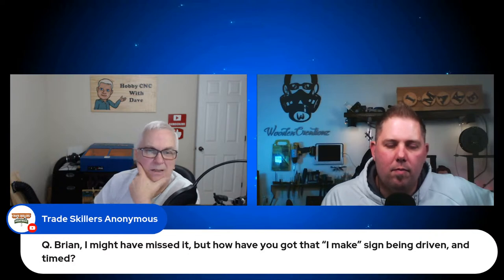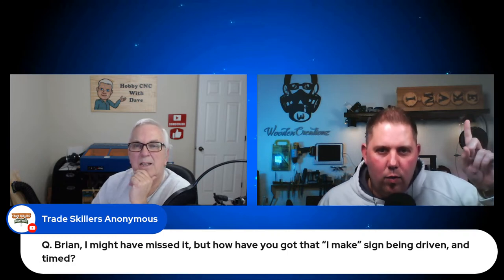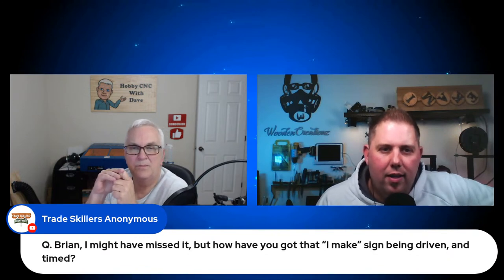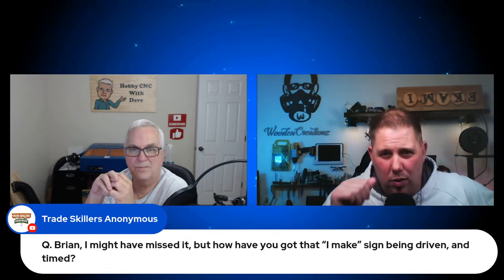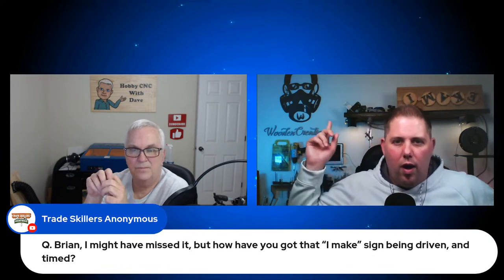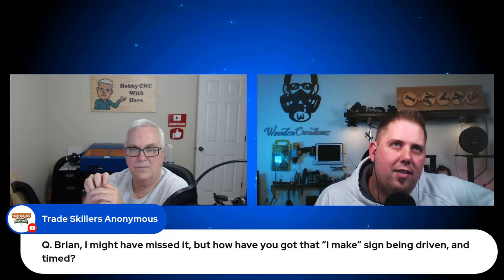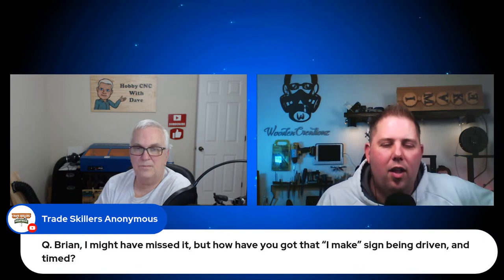All right. JR here from Trade Skillers Anonymous asks, Brian, I might have missed it, but how have you got that sign being driven and timed? So what I've got is a bunch of gears here. They're all meshed up together, pushed up tight. And then behind there, I have a rotisserie that you'd have for a grill. If you put a chicken on it, it spins. You can just get them off of Amazon or eBay. They don't cost a whole lot, under 20 bucks. It's got one rod that's spinning, only one gear, and then the rest of them spin. But I'll tell you what, it's kind of a headache. Once you get past two gears, it really becomes a headache because they want to bind. And if you watched the podcast last week, I had another one that I had made.